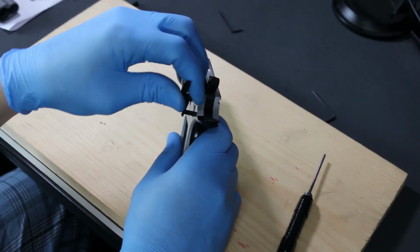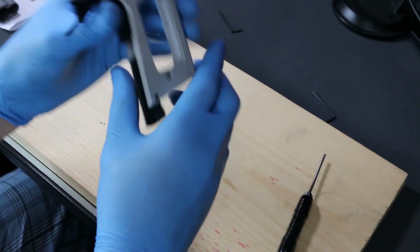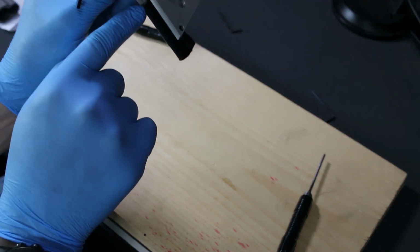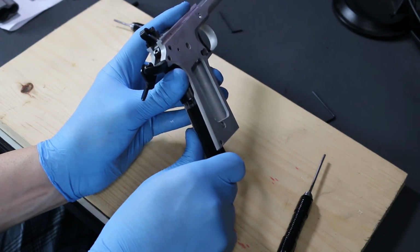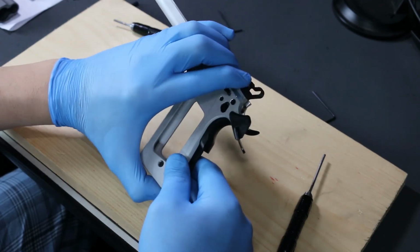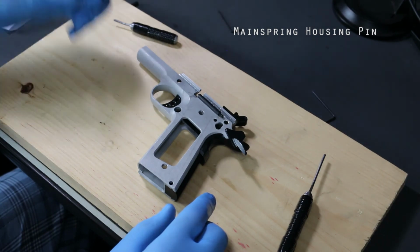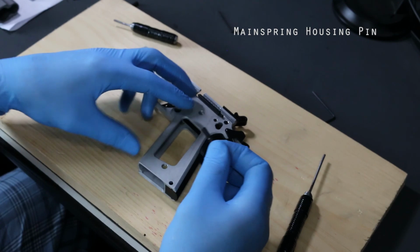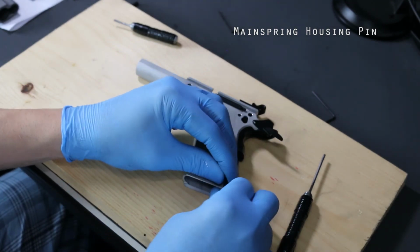So, from here, I use this opportunity. There's a small bar from the bottom of the trigger. It has to fit into the top of that back strap. So the back strap slides up. That bar goes into the top of that. So here we can go ahead and put our bottom pin in. Our bottom pin is the one that has the groove inside of it. So the bottom pin is going to go into this bottom hole and hold that spring mechanism.